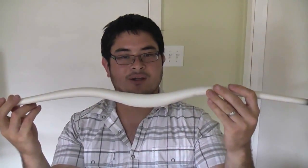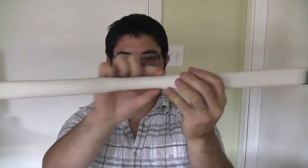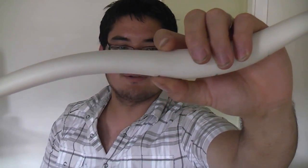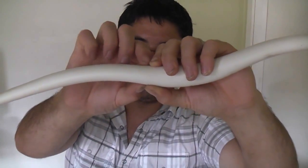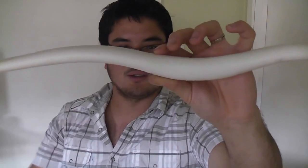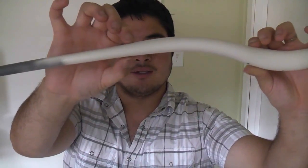So here's a bow that I'm currently working on. If you can see, I've smashed the handle just a little bit. Right here at the beginning it's almost full round — it's a bit of an oval. That's because of the spacer. The three-quarter inch spacer will make this sort of a thicker oval. That's what you want. You actually want it to be fairly thick, going all the way down, and then it gets thinner and thinner. And finally, the tip should be its flattest point.